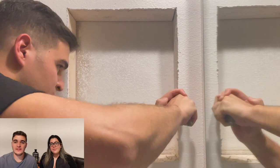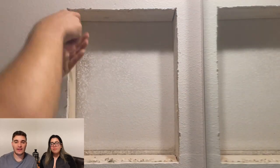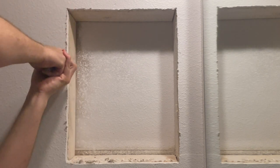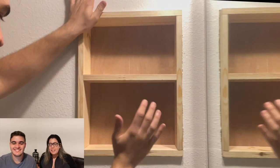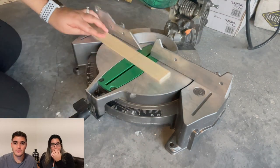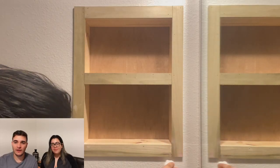Once we took the cabinet back into the bathroom, we had to cut an overlapping piece of sheetrock that was there using a utility knife. We then used our shop vac to go ahead and clean out any debris. After cleaning up, we put the frame into place and this time it went in nice and snug. Now it was time to install the outer frame. We used 2x2 project boards, cut them down to size, and used the vertical pieces to hide the edges of the horizontal ones. After lining up the edges of the framing strips, we nailed them into place using our nail gun. We then used Drydex wood filler to fill in any holes that the nail gun had left.